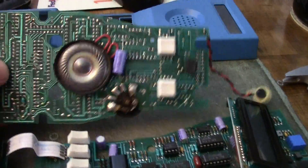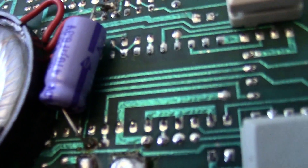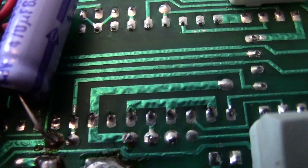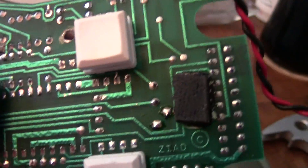The boards have silver runners on them. You can tell if the runners are wrinkled — see the wrinkles in there? For some reason the plating process with the silver makes the copper wrinkle. You can tell if it's silver that way. This whole thing, all the runners are silver. See the wrinkle.